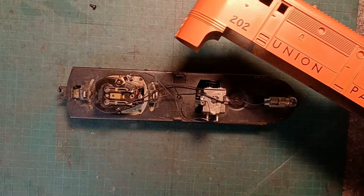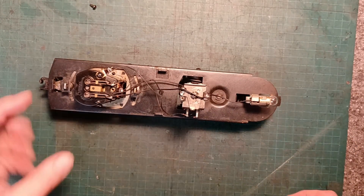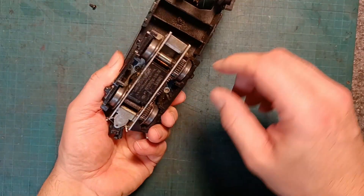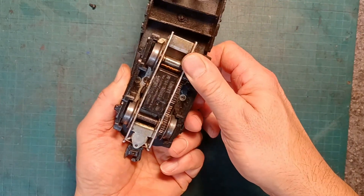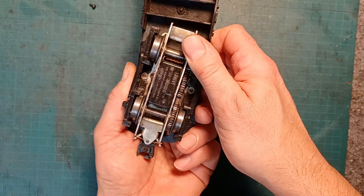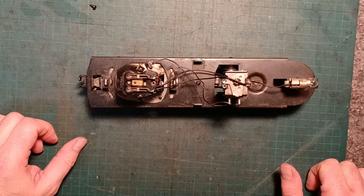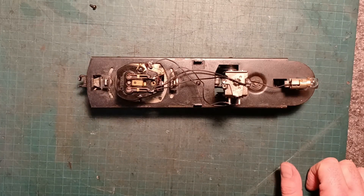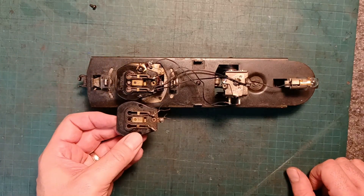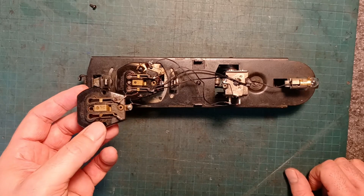I brought the 202 back on the bench because it's still not running right — I'm not happy with this at all. I don't know if it's just a terrible motor because these things are so cheap or what. There are no obstructions underneath anymore, it's well lubricated. I can spin it in one direction by hand really freely, but putting power to this motor nothing happens after I did have it running. So I'm going to try something else — I've got this extra brush plate that's actually the same type as what was on here, and I'm going to swap these two out and see if that makes a difference.